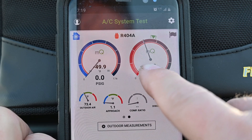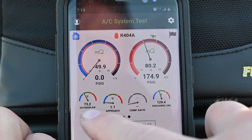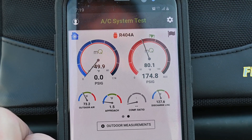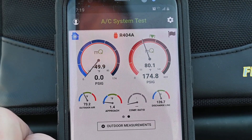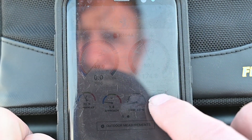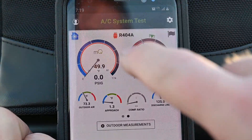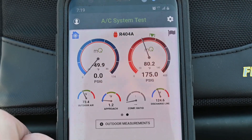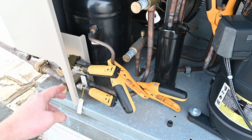My approach temperature is dropping. My outdoor air temperature is 73.4°F and my condensing temperature is 80°F, so I'm still warmer than the outdoor air temperature but very close. This system happens to be low on refrigerant — we have a sight glass and it's flashing. We're going to have to add some refrigerant to this; that's why it's short cycling. This is the MeasureQuick app — just a quick introduction to it.